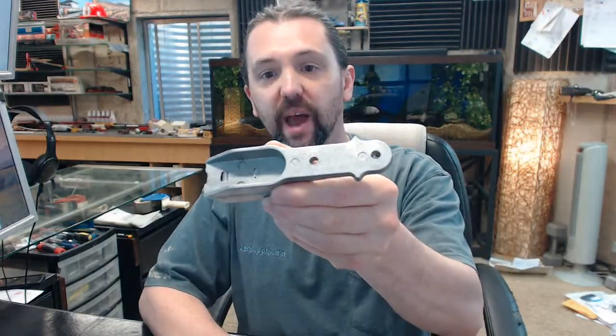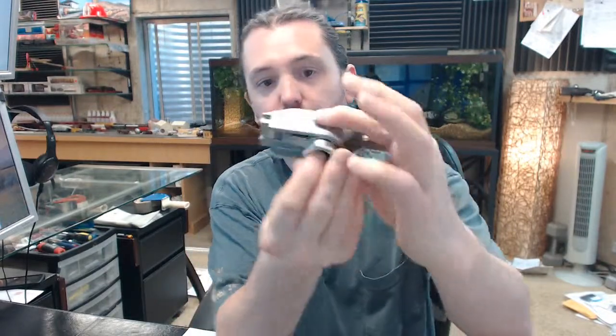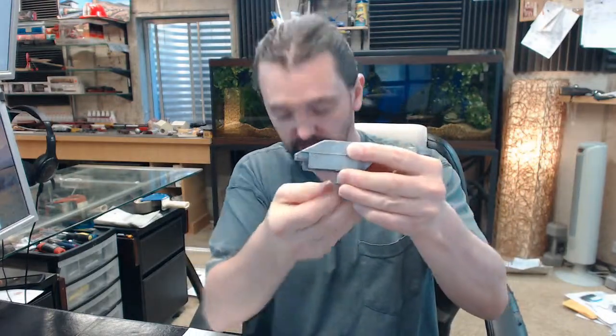So you're going to get the arm package, you're going to get the spindle, the bearing spindle assembly, and that's going to ride into the bottom arm, and that snap spring there is intended for what they call an end load, or when you mount the door, you're going to snap it in from the end of the channel. Okay, and it locks in.